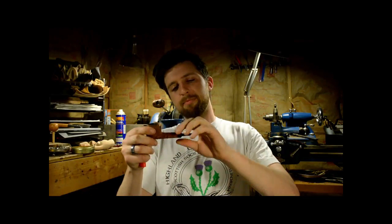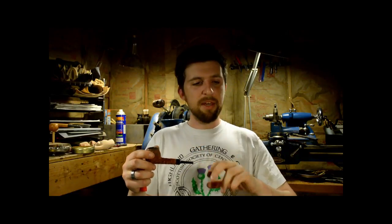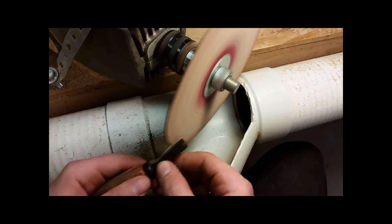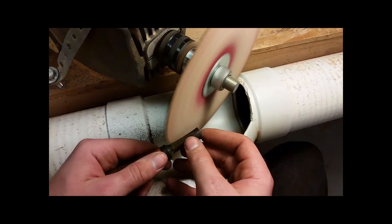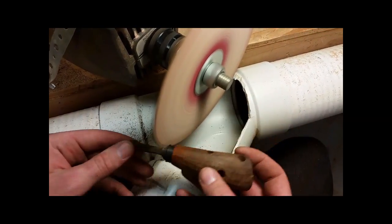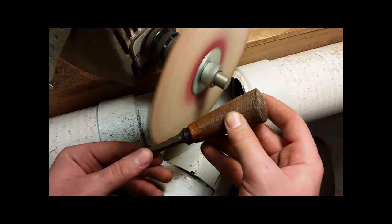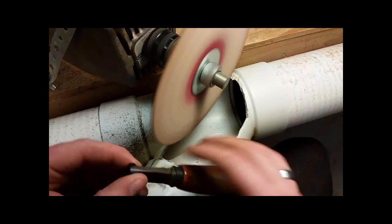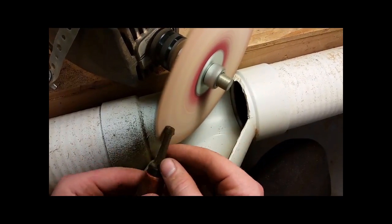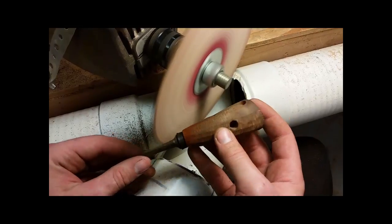Okay, so you have the blank stem. It's a rod with another rod in it that fits into the pipe. Now you need to shape it, so you're going to take it to the shaping wheel. And this is pretty delicate, and it's a pretty powerful motor, and so what you do is use good technique and finesse, and upright back, drop your shoulders, lock in with the elbows, and use your core muscles to move. Looks kind of funny when you're watching somebody do it. And then once it's shaped, with some practice, you can get pretty close to this final shape on the wheel.